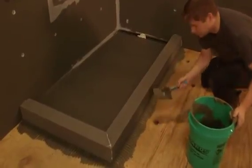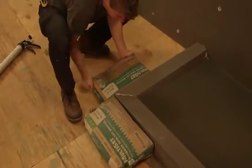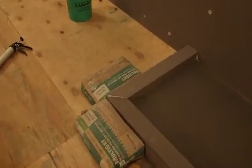Once the curbs are in place, excess thinset is flat troweled against the bottom of the curbs, pushing extra thinset support under the curb to provide a very solid setting bed. All thinset not needed is removed and weights are placed to keep the curbs under compression until the sealant has sufficiently cured to provide strong adhesion.